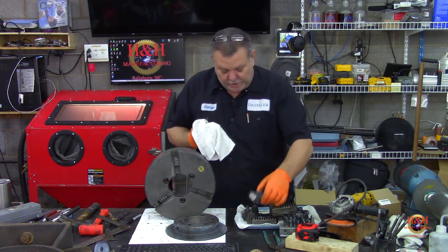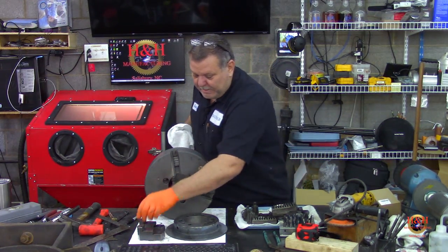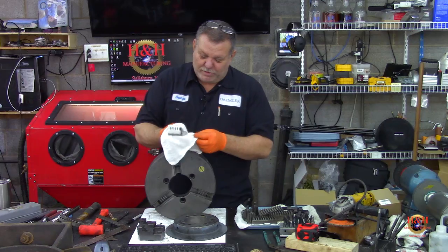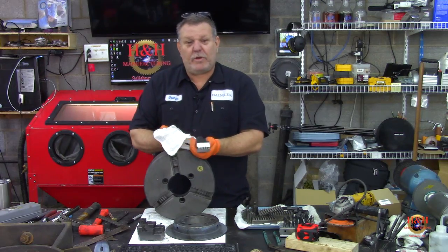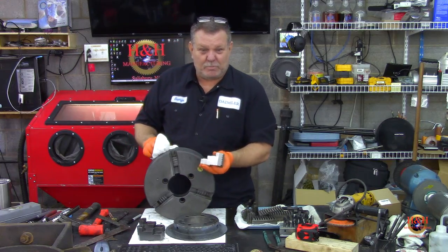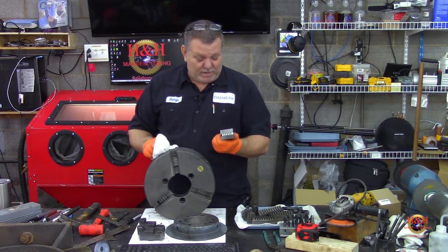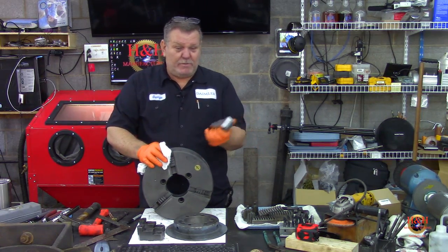I still think I'm going to run it through the sandblaster and polish up the surfaces to get it nice and shiny. I did one of the jaws — look at that, that thing looks gorgeous. That was just sandblasting it, then running it on the wire wheel, then on the scotchbrite wheel. Didn't take any time at all. Still haven't found hardly any signs of wear — it's crazy. I'm not going to bore you with a bunch of sandblasting, so let me get these parts done and then we'll put this thing together.